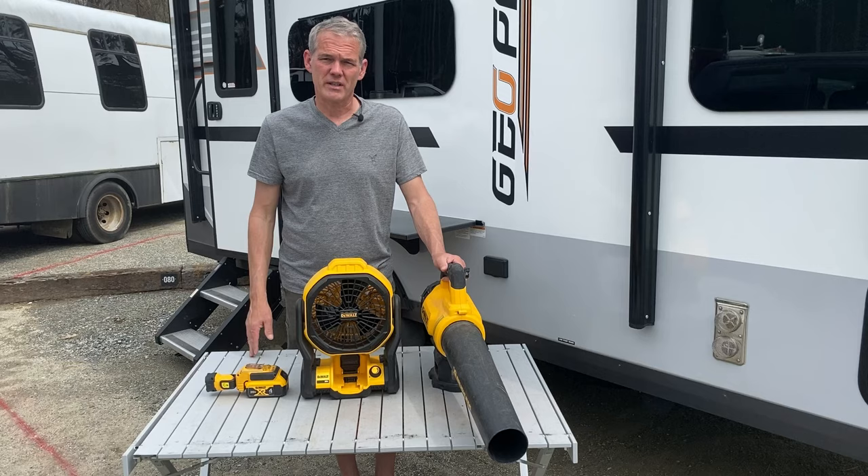If you watched last week's video, you know we made some changes to the cabinet under the TV. But this cabinet under the stove is just kind of a big wide-open space, and I store things like my Instant Pot, pans, cutting boards, and dish rack under there. I found that while traveling, every time I pulled one thing out, everything just fell over. So I found these bakeware organizers at Ikea — two of them for around $5. We installed one under the cabinet, adding some blocking material underneath so the screws had something solid to go into besides the thin cabinet bottom.